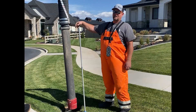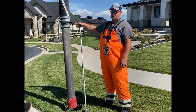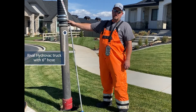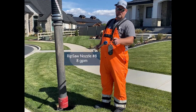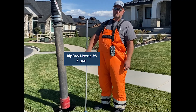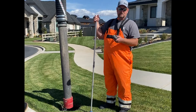I'm from Hydrovac Excavating. I'm Trevor. We used a Rival Hydrovac truck. It has a six inch hose. The PSI we use is 2,500 PSI. We also use a rip saw nozzle — number 8 for 8 gallons per minute — and everything's done by remote.